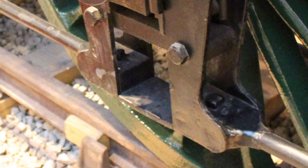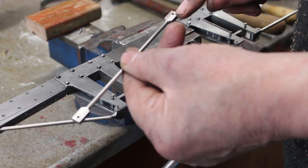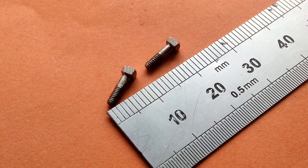When you look at the photographs again, there are some little bridging plates at the bottom of the horn plates. These are held in place by square-headed bolts that go through the rod. So I've drilled the rods at the end here to take the square-headed bolts, and I've made some little bolts as well.